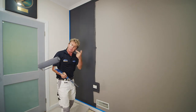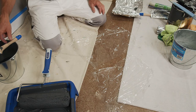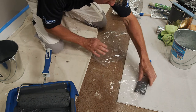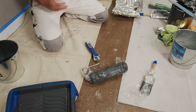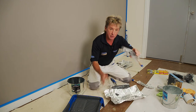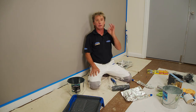All that's left before you reload is to smooth that over to make it really smooth. Now in between coats, don't wash anything out — simply wrap your brush and rollers up in cling wrap. It'll keep them moist for a few hours or even overnight. But if you're not going to paint till next week, get alfoil over the top of the cling wrap and they'll be perfect.